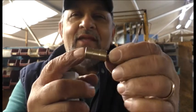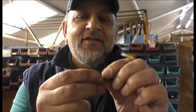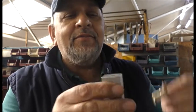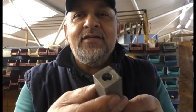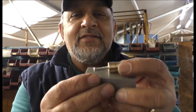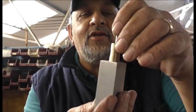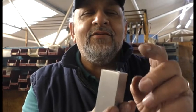Okay guys, after hours and hours of hard work, we finally got there. So this is it, right? And it's not the best of machining, you know, but it's working. So this one as well has been reamed out. And look at that. That goes in, right? Far in as well. So looking at possibly going in as far as that. Like that. So as far as that, I'm happy with that. And just to make sure that we have compression, perfect. See that? And in theory, it's supposed to go down slowly. There you go.